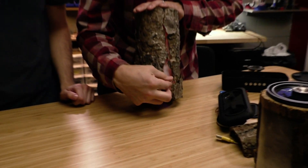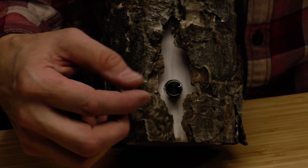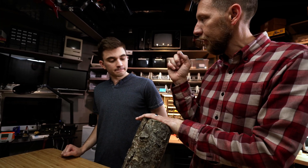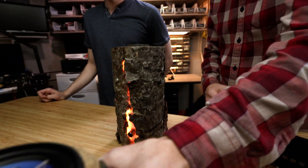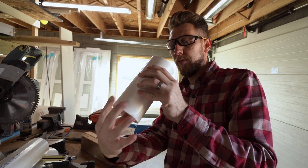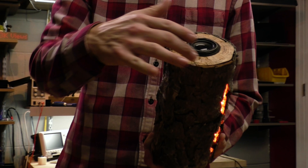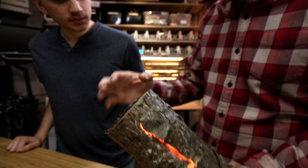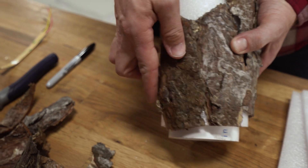For the lighting — you can turn it off, turn it on and set the intensity. After you get past the top 10%, it goes into sound mode. I took one of the connections of the speakers and ran it through a 10K resistor into the Arduino, and then it senses the music — so whenever you play music, it does that. The construction was quite a bit different from version one. I used a smaller three-inch tube with foam around it to get the depth for the right lighting effect. The only part that is actual wood is this top disc. The rest is bark I pulled off other pieces, and I brushed latex over it to keep it resilient so it's not chipping and falling away.